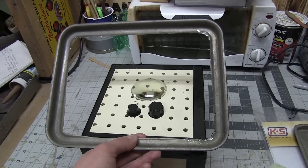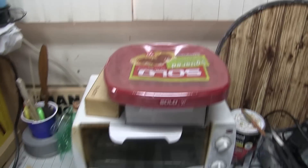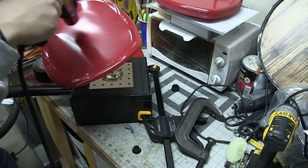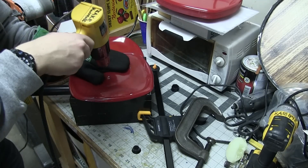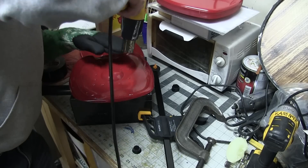So with this small surface area platform, it's possible to vacuform with absolutely no tray, using solo cups — plates, sorry, still in college mode. I heated those up with my heat gun and pressed the plate onto the platform. You'll notice that I'm continuing to apply heat until I get a good seal.